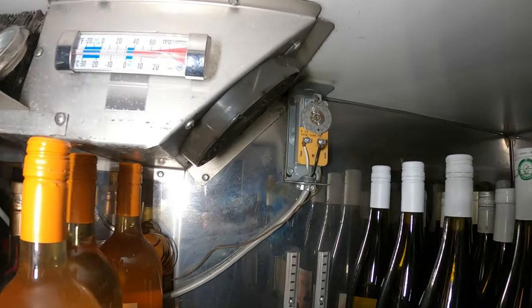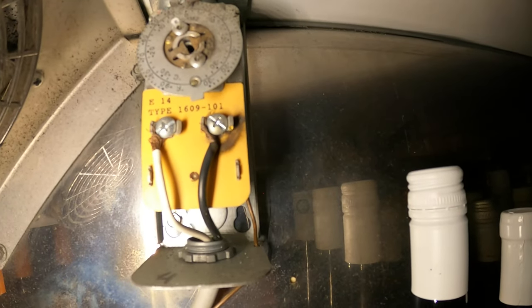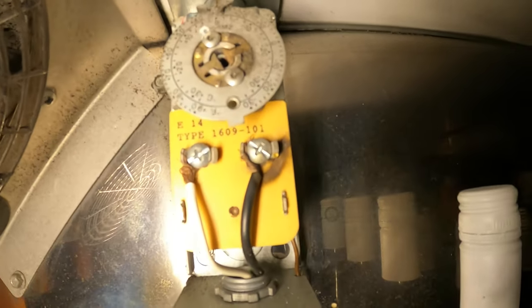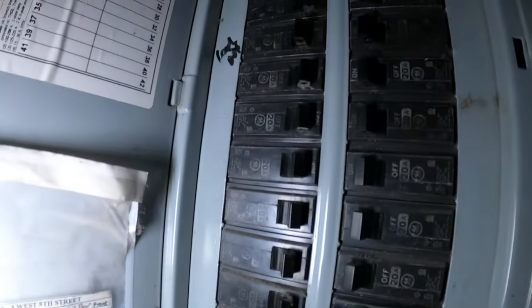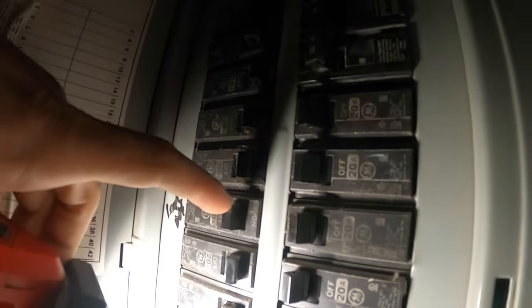Alright, just cleared out a few bottles. Look at that burn mark to the right of the black wire. So I found the breaker panel behind these walls and right away I know it's this one. Look how it's in the mid position — it's not on and it's not off, it's in the mid position. It's tripped.